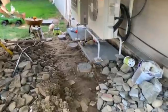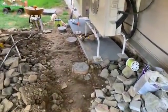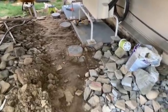Today I'm going to construct a sister beam for my deck so it takes a little bit of load off the house and gives it additional support. What I've done so far is place the foundations for the four-by-four posts - I have four altogether. I'm going to raise up the posts right underneath the joists of the deck and span a two-by-eight across.